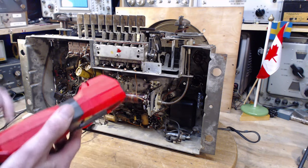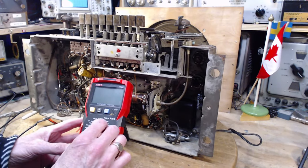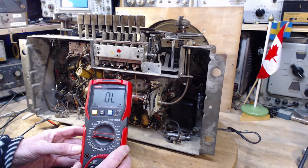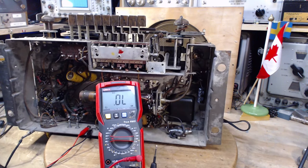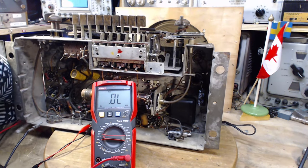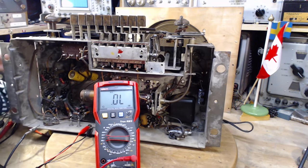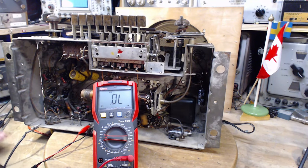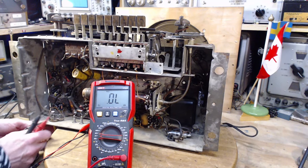So we're going to do it with this meter here, my Allen meter. This was sent to me by a kind viewer named Alan. Okay, now, the field coil is plugged in over here, and I should pull the plug out on the radio. Yeah, it's just better to have the plug out while I'm doing stuff like this. So I'm going to pull one leg of the field coil lead out. There it is.